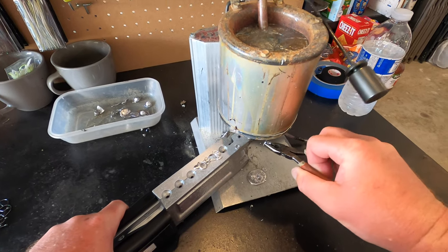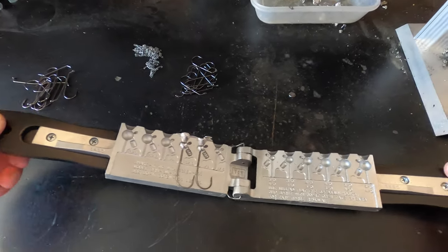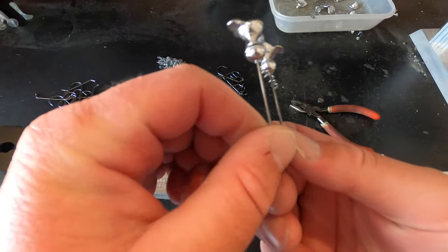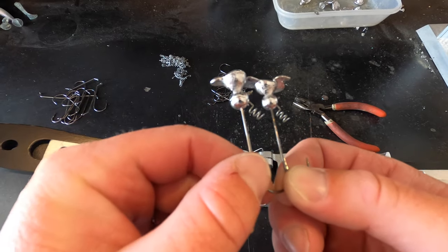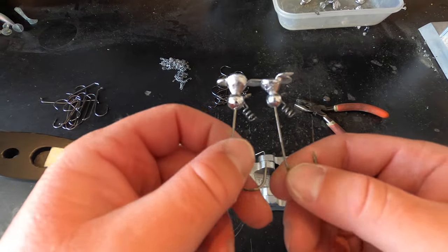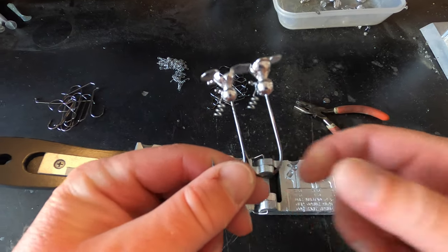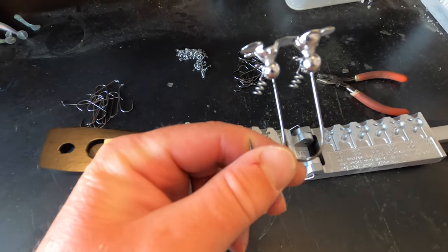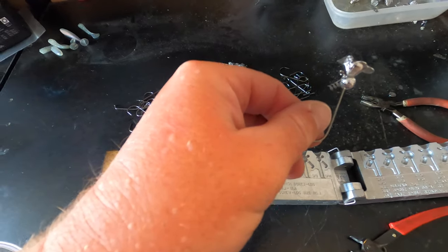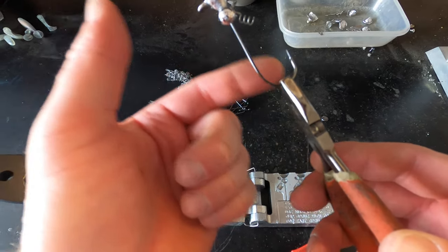We might have one bad one because the lead overflowed a little bit. Plugging the spout back up and checking — I actually got lucky and it kind of filled out. You can see it's got like two layers to it; that's definitely fishable and good enough, but I'm going to re-pour that one just so I can show you guys a nice finished one. I'm also going to use this as an example of how you can remelt bad pours and reuse all these components.